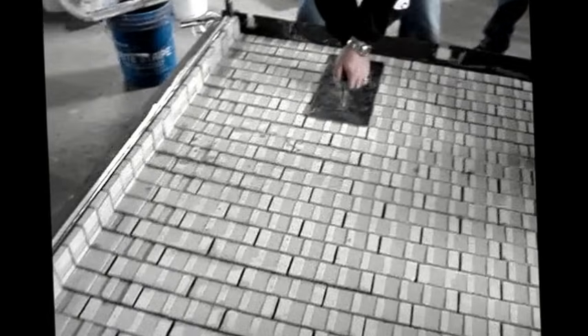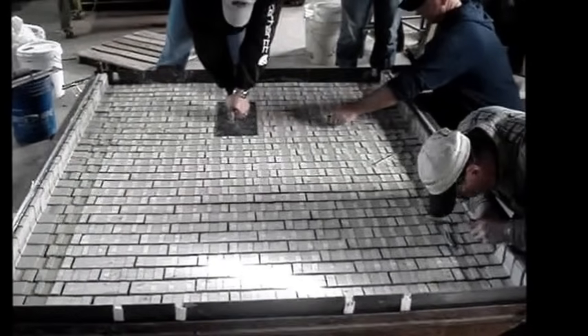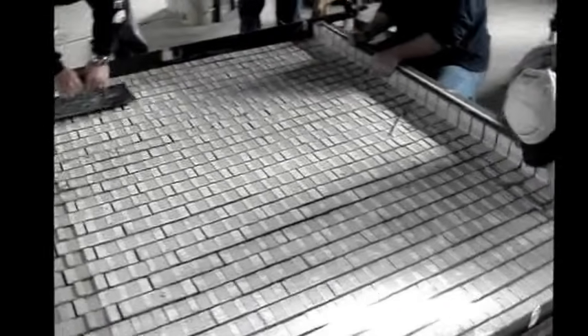Here's the car with everything almost completely laid out. Joe is pressing on a flat piece of metal that helps to seat the thin brick into the paper clay. The paper clay is still wet, and it's important that it remains wet throughout this process so that the bricks are somewhat adjustable. You'll see here some of the guys are working the back of the joint to make sure the joint has a uniform appearance. The amount of paper clay that squeezes up between these thin bricks creates the joint effect.